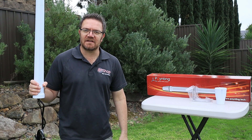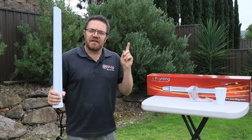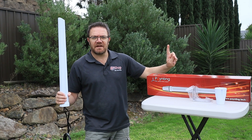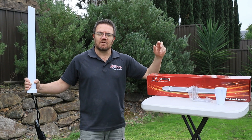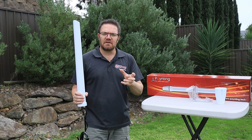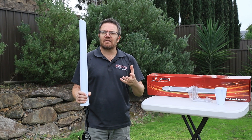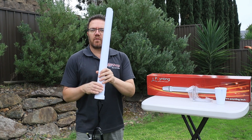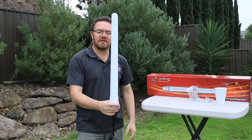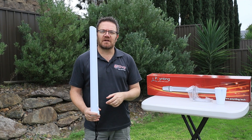Having two antennas means they won't face the same issue at the same time. One antenna may have problems with reflections or obstructions, while the other is likely to be clean. You can play with height to help with reflections, and place them on both sides of the boat or in different areas. With two Omni 402s or something similar, you get that extra level of signal discrimination.